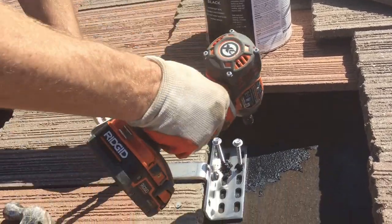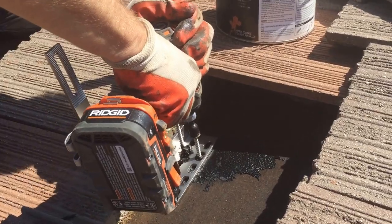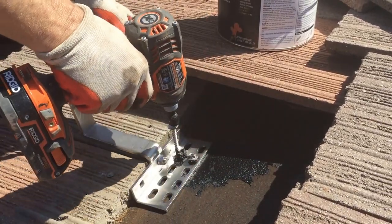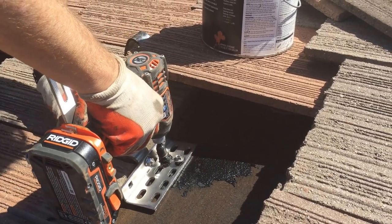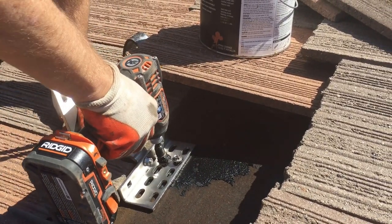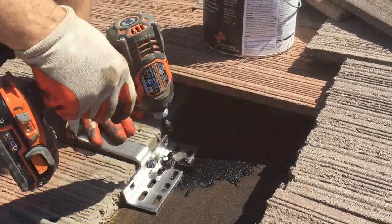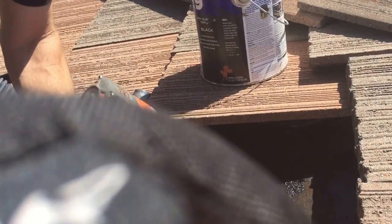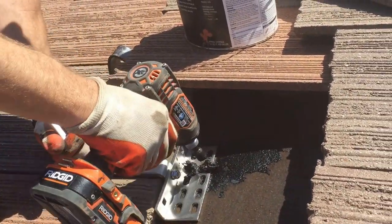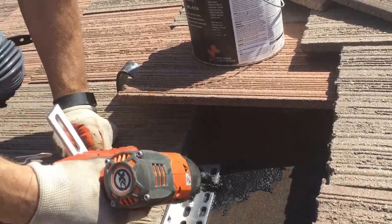Stick it on there, and you should hear the drill ratchet all the way in, like that. Otherwise, you're not in a stud. Now, I'm gonna center that where I want it. Get it all the way down. This actually will break this mount. So if I can move this mount, then I know I gotta do it a little bit more. Okay, now I can't move it.